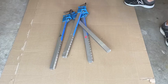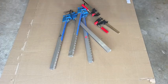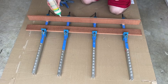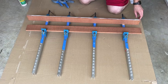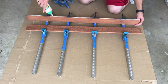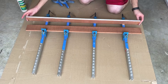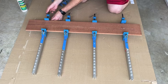Because nothing's ever where it's supposed to be in my shop, I found my bar clamps. I had to go hunt for my F-clamps and some pieces of plywood covered in plastic wrap, which I'll use as cauls. I ran a bead of glue down one board — because I'm a one-side glue kind of guy, trying not to be wasteful. I tend to go easy on the glue the first time, which I did here, and I usually realize about 15 seconds later I shouldn't be so stingy with the glue, so I add some more and spread it around. Put those into the clamps, line things up perfectly, and tighten them up.